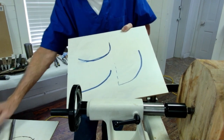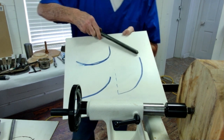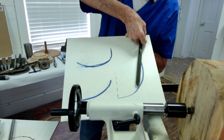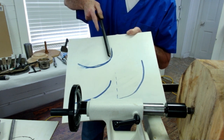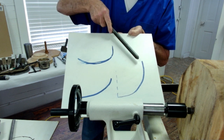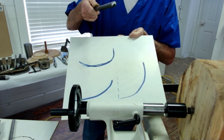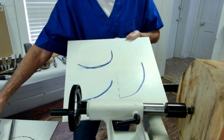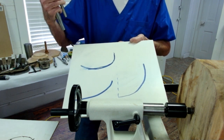Even on a 55-degree grind, I'm probably okay on this bowl here, coming in at 55 degrees and picking up the bottom of it. Steeper side, I'm stuck on it too. I'm gonna have to go to a bottom feeder. But I can do more bowls with the 55, but it's a blunter tool, and it's not gonna give me as good a cut. And what I wound up doing is I use the two gouges for bowls.